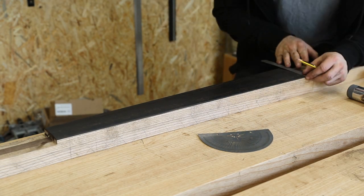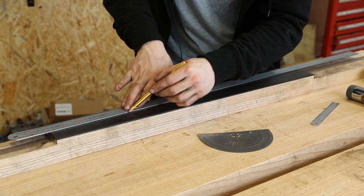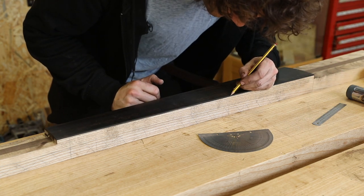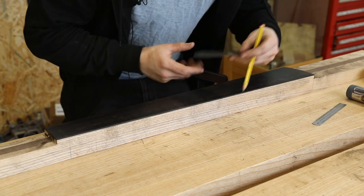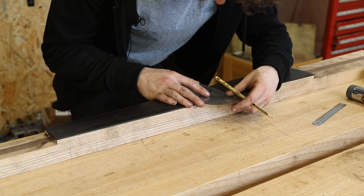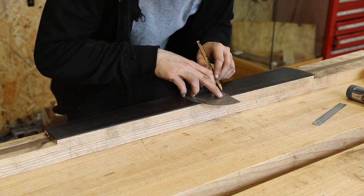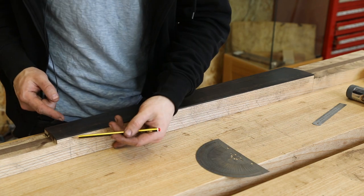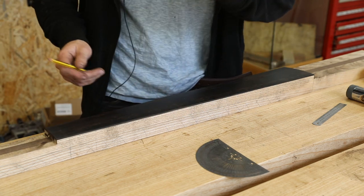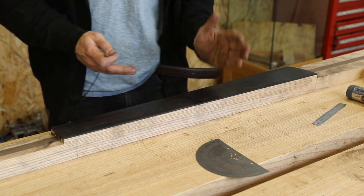I'm going to start by drawing a new centre line on here, and then we're going to find where that perpendicular tenth fret is. I've got that from the line I drew up the side earlier, and I'm going to get the protractor lined up with 90 degrees along this centre line with the bottom part in line with that tenth fret to get a lovely perpendicular line. I'm going to redraw the nut locations coming from the tenth fret just to make sure everything is in alignment, because there are chances for small misalignments from transferring measurements back and forth.